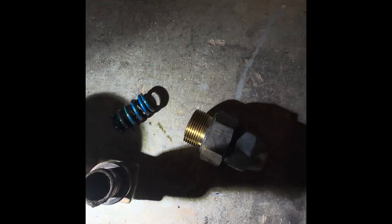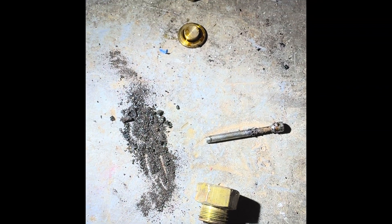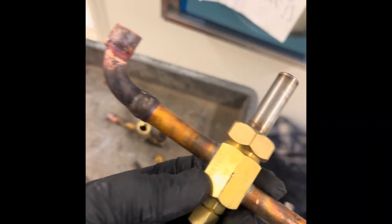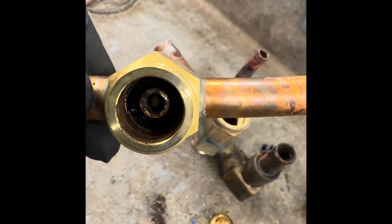That's what I got out of there. I was able to poke all the stuff out of that liquid line that was plugged, and it's right there. I don't know if that's all desiccant out of an old dryer or what — it could have been an old dryer that let go. This is the solenoid valve that goes into the pipe that went into the TXV, and in there it's not looking the best. So I went ahead and sweated this out. We'll work our way back and see what else is plugged up. I think this line is all compromised as well. The liquid line solenoid valve is full of crap.